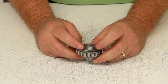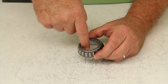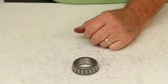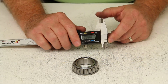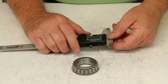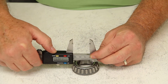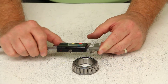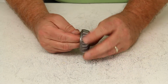If you don't have the bearing number, the other thing you would have to do would be to measure the inner diameter. That's the critical measurement of the bearing that fits on the spindle. You need to use a digital caliper to get a correct measurement because it is measured in thousandths of an inch, so a ruler or tape measure wouldn't work. In this case, if we measure the inner diameter of this bearing, it would measure 1.250.